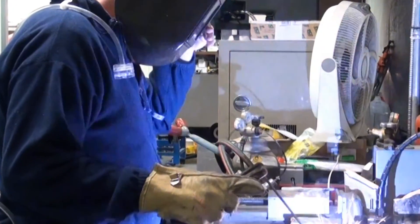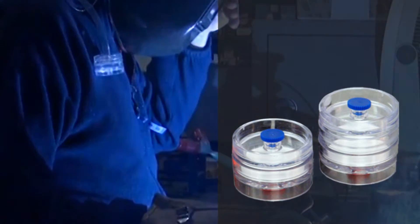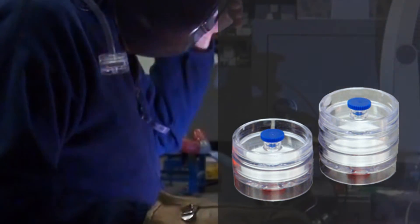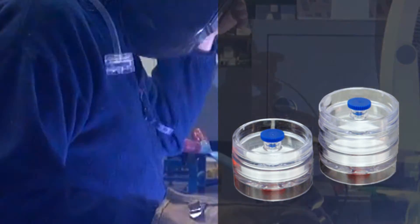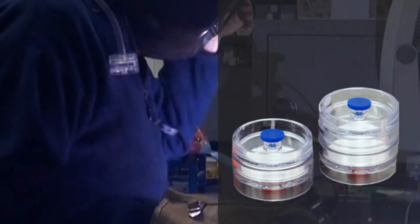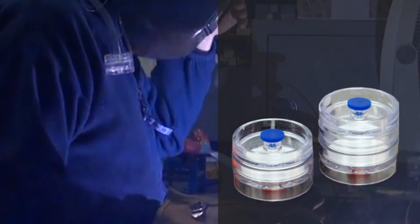In the United States and other countries, many aerosol sampling methods for air monitoring in the workplace rely on using a 37-millimeter closed-face filter cassette. Airborne particles drawn into the cassette are deposited on the filter as well as the walls of the cassette. The subsequent analysis for elemental content using only the analyte deposited on the filter can result in inadequate and underestimated results for worker exposure.